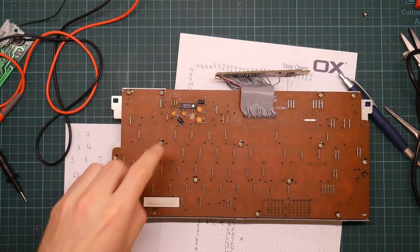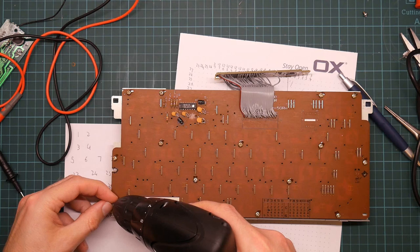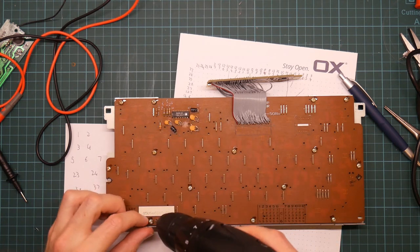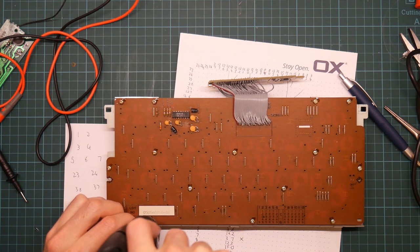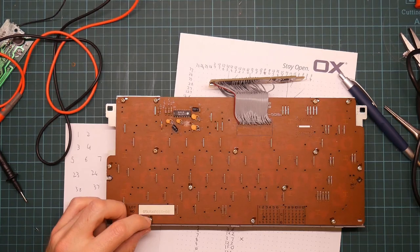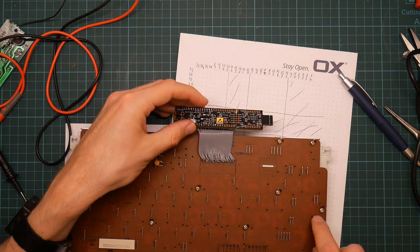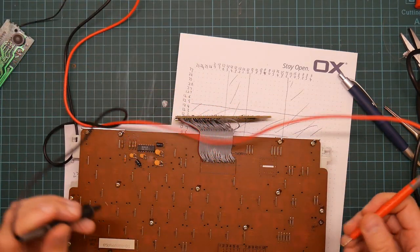And one thing I absolutely do need to do is to figure out what this stuff up here does. It's related to the caps lock key, that I know, because one of the pins is connected to the LED. But I don't know why there would be a NAND gate here to run it. Surely the LED is driven directly from the board. Which actually... I should have mapped out whether the LED was connected to pins on the microcontroller. Luckily, the LED legs are exposed, so I can do that without taking the bottom of the board off again.